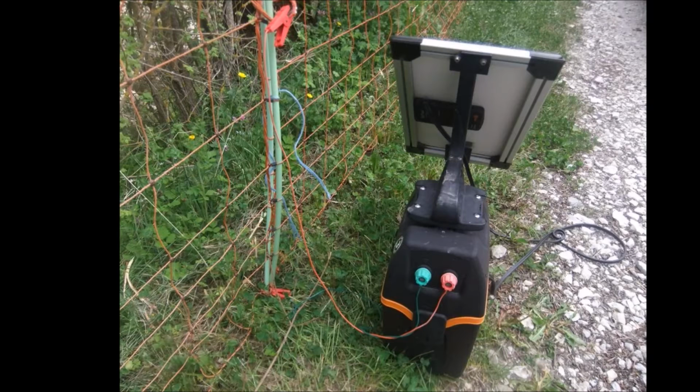Usually you'll hit rock at some depth and you won't be able to go any further. So that's probably the main disadvantage, especially if you're fencing with a smaller Energizer. Can you have 3 very short earth stakes, only 5 or 6 inches? You'd be better off to have 1 earth stake that's 1 metre long if you can get it into the ground.